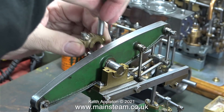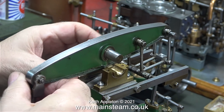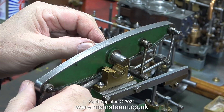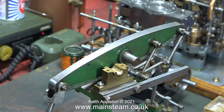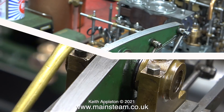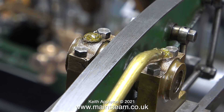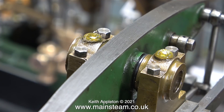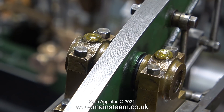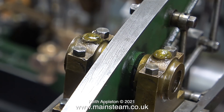To stop the side play entirely, I will fit a couple of silicone o-rings, one at each side. The customer also mentioned that he thought the connecting rod was bent, but I don't really see that at the moment. With the o-rings fitted and the top caps replaced, it's time for a good oiling. One good thing about using silicone o-rings in this position is they act as an oil seal, and because they're currently a bit on the dry side, I'm applying some oil to the actual o-rings.